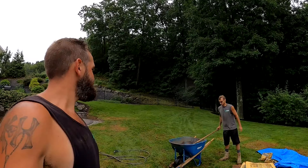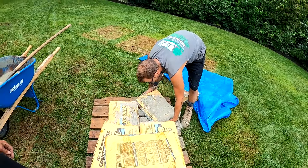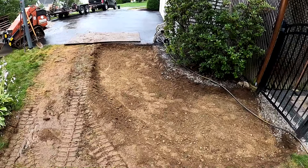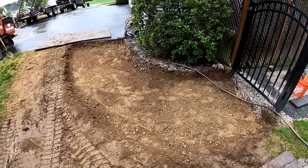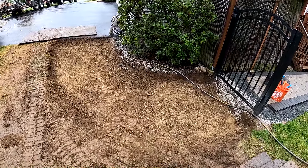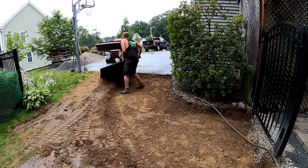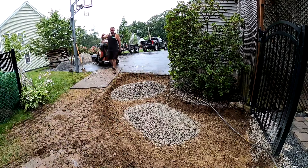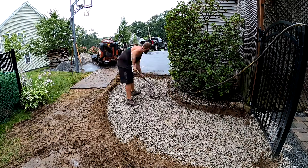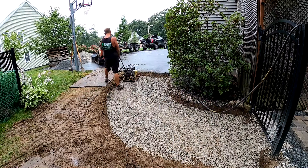We are all excavated out about 10 to 11 inches throughout from final grade. The next step is backfilling: we put a thin layer of three-quarter inch stone — about one to two inches — rake it out to the grade and level we want the sub-base to be, and then compact it. We get to the sub-sub-grade we need, spread out this thin layer of clean three-quarter inch crushed stone, rake it out smooth, and use our compactor to really compact this into our sub-base.